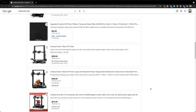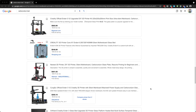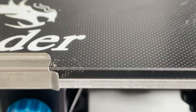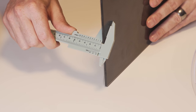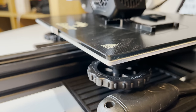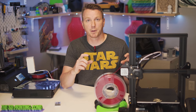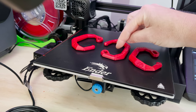If you check out some of the printers available today, especially those by Creality, these beds are becoming more and more common to ship with new printers. A lot of Creality printers, including the Ender 3 V2, come with these beds. If you buy the aftermarket one, it's got just the Creality logo. These ship on a glass bed — it's a coating that goes over the top of the glass. They measure around three and a half to close to four millimeters thick, so the glass is pretty sturdy and shouldn't cause any warping issues.